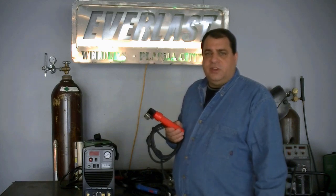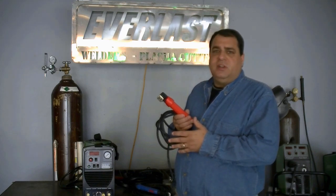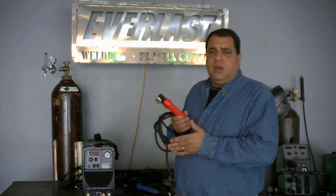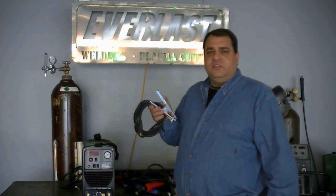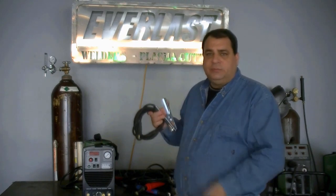For those of you wanting to do a little stick welding, this is a stub type electrode holder. This is not the conventional tong type, but it allows you to work well with pipe or any other kind of material. This is the work clamp. It's pretty heavy — it's got a copper strap in there, so it can carry a lot of power without overheating.